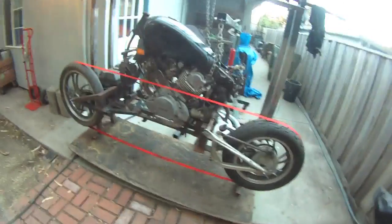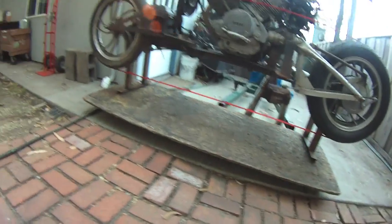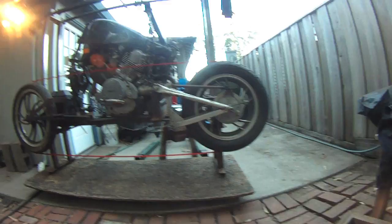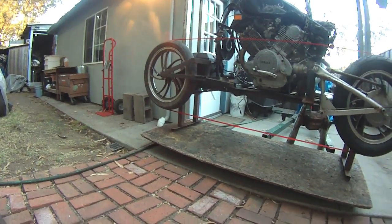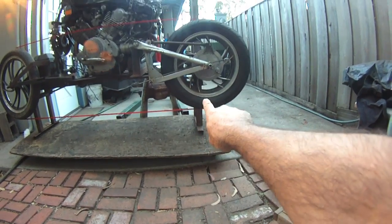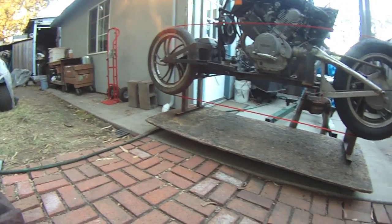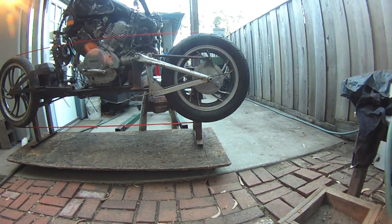Horizontal bandsaw. I went through great measures to make sure the bottom of the wheels were lined up, because that's really most important. It's pretty obvious that the back wheel is a smaller diameter wheel than the front. That really didn't concern me. The biggest concern is to keep this distance from the bottom of the trolley frame to the live edge of that blade the same on both sides, so you can cut nice square boards and square beams. And I think I accomplished that. Well, I know I accomplished it.